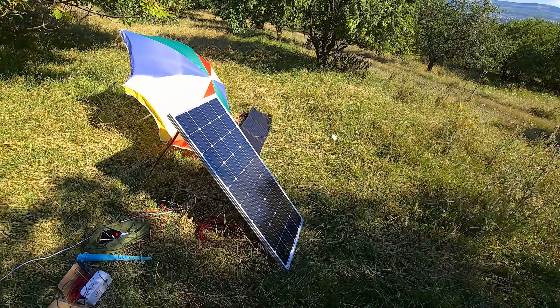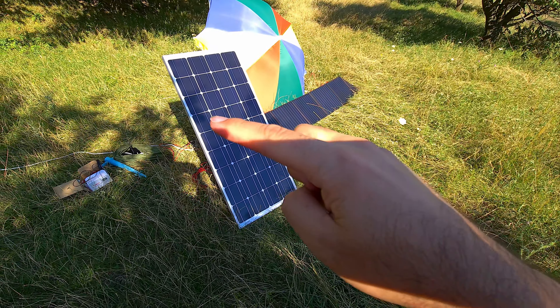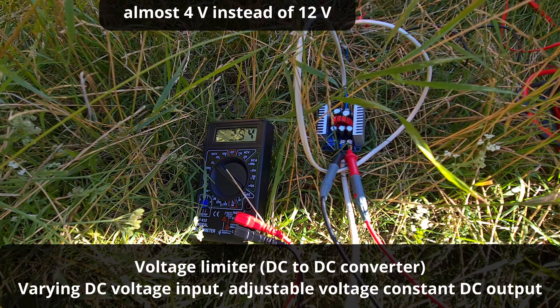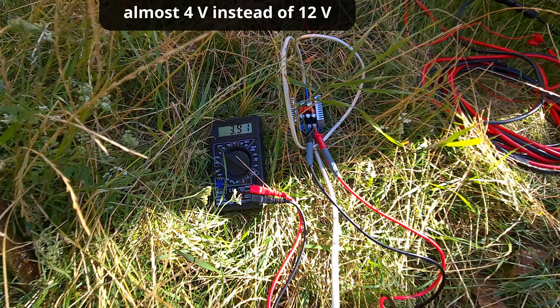The smaller solar panel is charging the battery behind it, and the larger solar panel is directly charging the fridge — so there is no battery connected to the fridge circuit. If I stand in front of the solar panel, the fridge would be blocked and stop. The smaller panel charges through a charge controller into the battery.